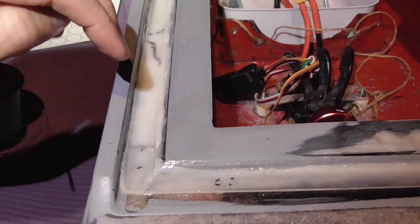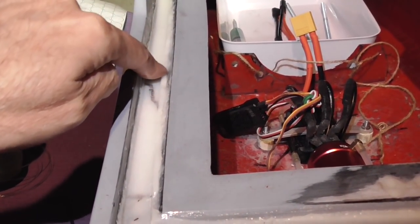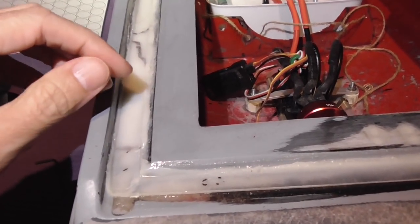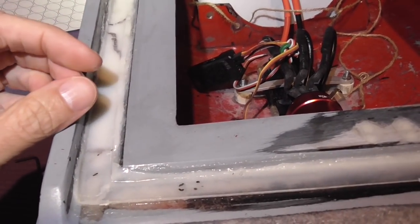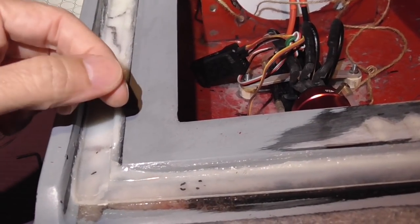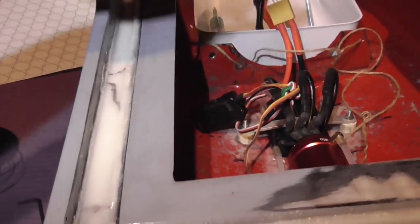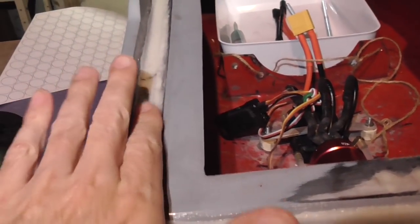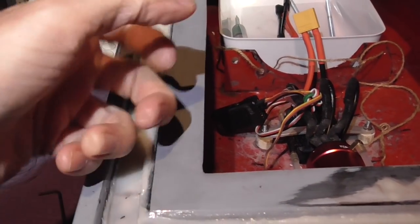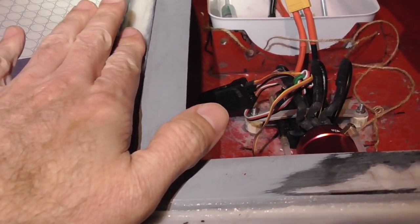The seal on the lid here worked great, so I'm glad I put the time into doing that. My original plan was to do that and then to also use some of that seal that you use for vacuum bagging, sort of like chewing gum kind of stuff, because I did a test and I found that if you leave it in water for even just a couple of hours, it loses all the sticky from its surface, but it retains its soft, squishy, rubbery chewing gum sort of texture. So if you were to make one of those and then put it in here and stick the lid on, it wouldn't actually hold the lid down very well because it would lose its sticky, so you could still pull it off. But as long as it was being pressed down, it would seal the water out quite nicely.